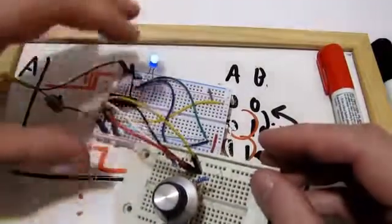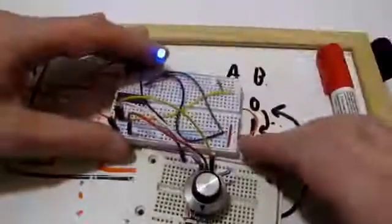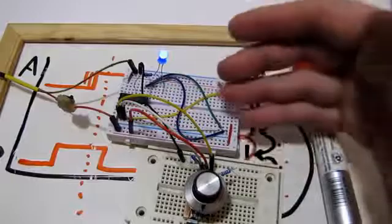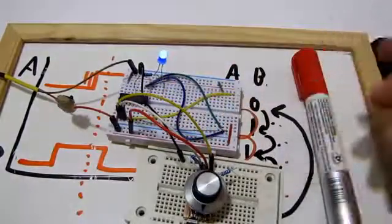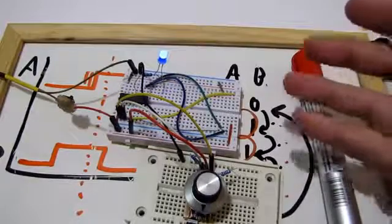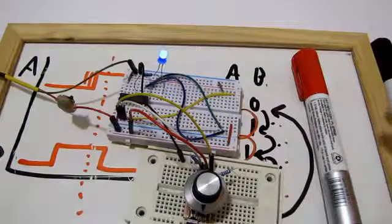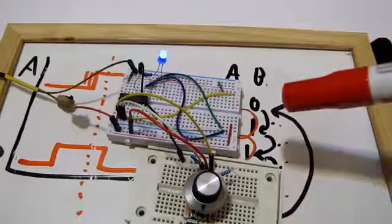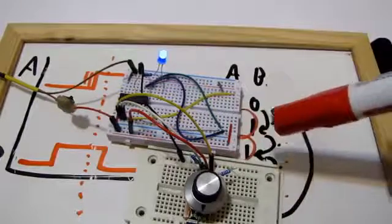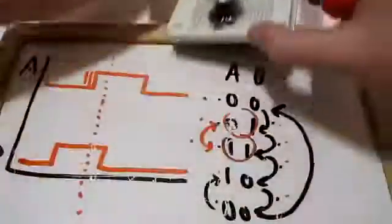Because without them, you can have lots of little bounces that will choke the application code on your microcontroller, because it will be busy handling all those successive interrupts. If your microcontroller needs to do something else — like handle other interrupts, timers, or time-critical code — this will be a bottleneck. So for fast bounces, you really want capacitors. The long, confusing bounces are handled by this system.